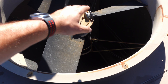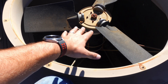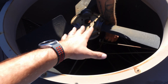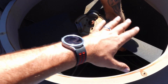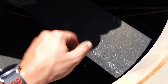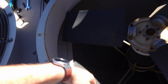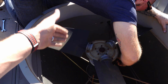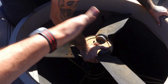Something I recommend: whenever you do the motor, just go ahead and do the fan blades too. These things are expensive to begin with — you're talking six, eight hundred, a thousand dollar fan motors. And the blades are usually a couple hundred bucks, if that. You will spend more time and man hours trying to salvage that blade than just getting a new one. Besides, this fiberglass gets so worn and brittle that it gets bad. And when the bearings get that bad, a lot of times it'll rub the sides and eat into the fan blade. Next thing you know, you'll have a new motor and your fan will break or get out of balance — that bad blade will rattle so much it'll wear the bearings out in your brand new motor.